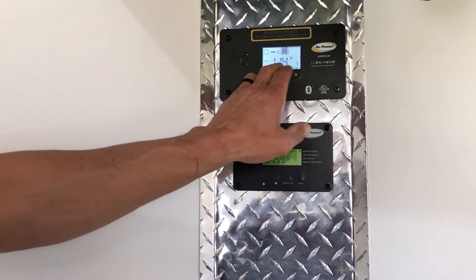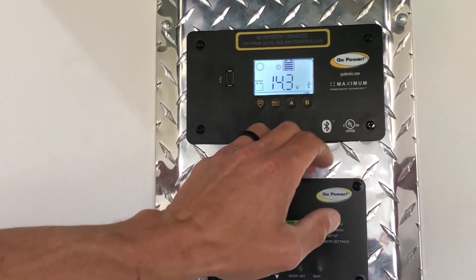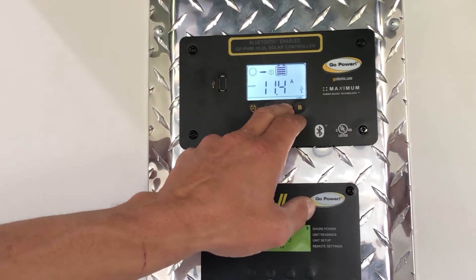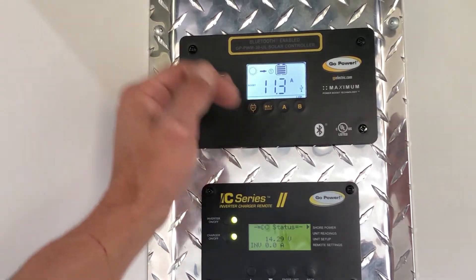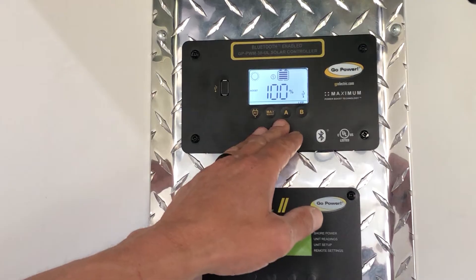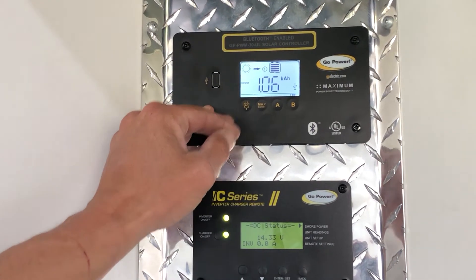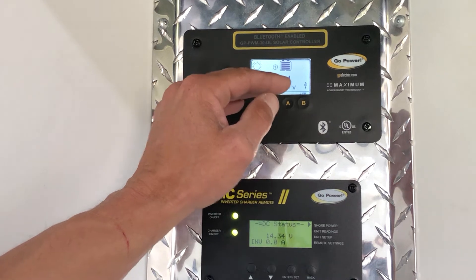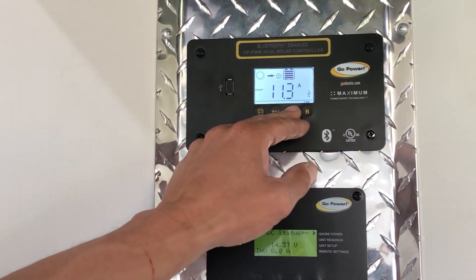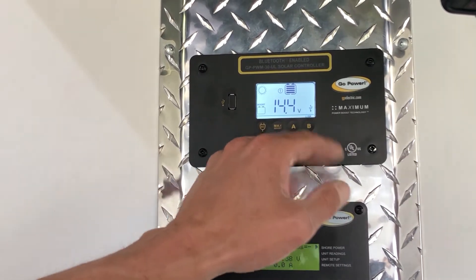Working our way back over, we have the A button. Right now it is fixed on a certain screen. If I want to trigger through the screens I can use the B button, but if I want to casually cycle through, I can hold the A button down and about every two to three seconds it will cycle through a different screen - basically like a rolling demo mode. We have battery percentage on one screen, how many amp hours this solar controller has brought into the battery bank since it was hooked up, and battery voltage, then it goes back to how many amps we're bringing in. If you don't like this feature you can turn it off - just hold the A button down again, hear a click, and now as you cycle through you can leave it on one screen.